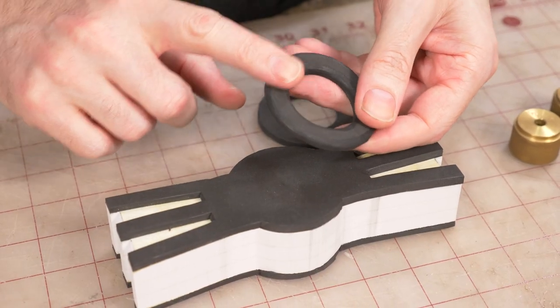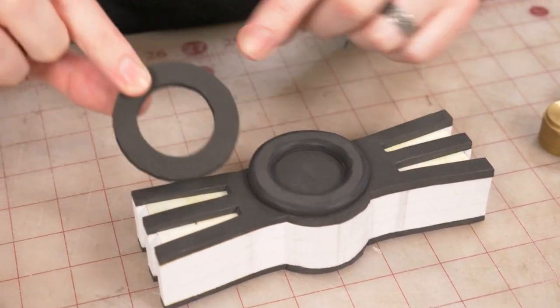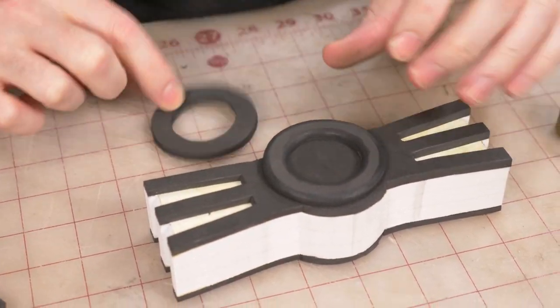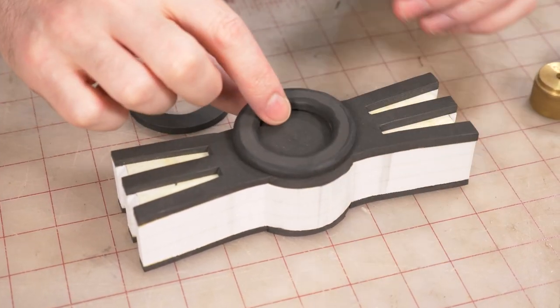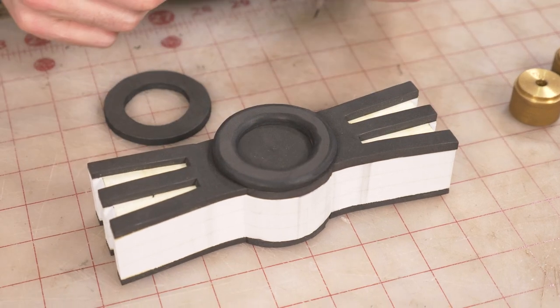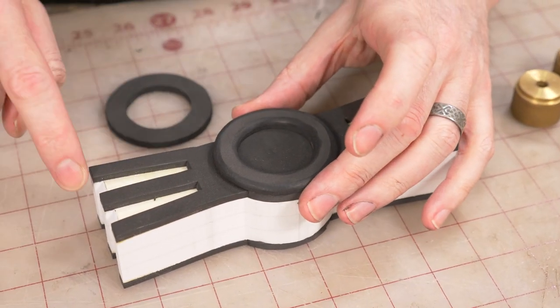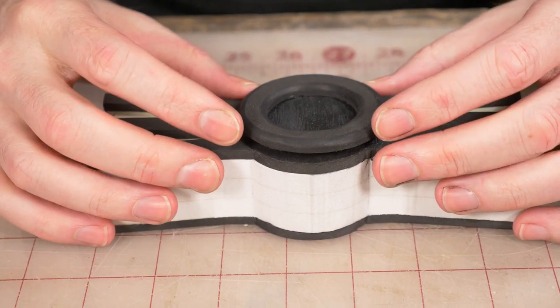I used the rotary tool to add a roundover on the top edges here, compared to the original right there. I'll do this one in a second. I did that because I'm gonna do that with a lot of these edges, and at least for this one, it was easier to do before I glued it down, but I will have to come in here and round over all these edges as well. But now I can glue this down.